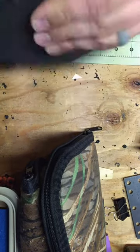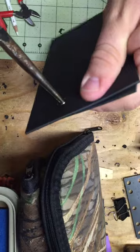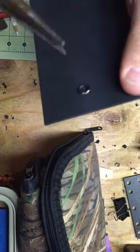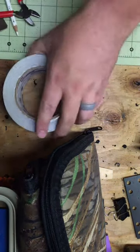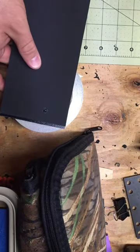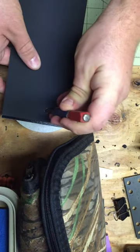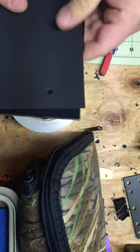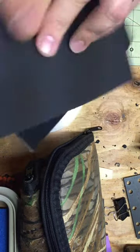For the most part they were pushing out, but you might grab just a set of needle nose on this side — try not to mar that Kydex up too bad — and give it a little twist. Here's the other thing that I use: my foil tape. Place the Kydex over that, and then with a set punch, I pop the set punch right on top of that flower, give it a good couple taps, and that sucker pops right out. The Kydex isn't damaged at all.